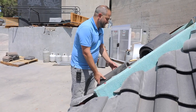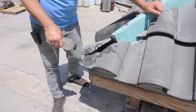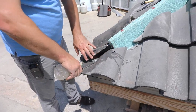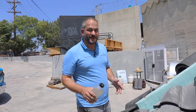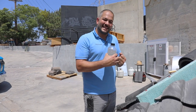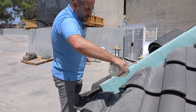The other thing we're going to be doing is spraying water on the areas that we're mortaring. The purpose behind this is to let the concrete absorb some moisture. In any concrete or mortar application — whether it's a tile roof or a tile floor — if your tile or the surface you're bonding to is too dry, it automatically sucks up the moisture from the mortar and doesn't allow for a good bond. So you just want to wet it a little bit.